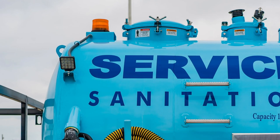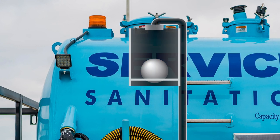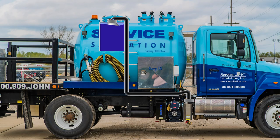Your pump's first line of protection begins with the primary shutoff trap. This trap is often welded into the top of your tank at the manhole and utilizes a float ball to shut off the air suction as the tank begins to reach the top. This trap is extremely important as it prevents wastewater from entering into the pump and potentially onto the ground.